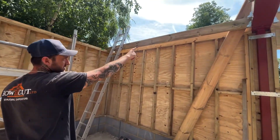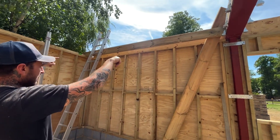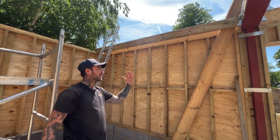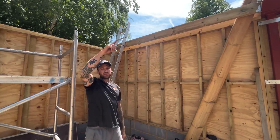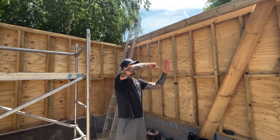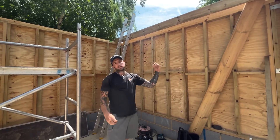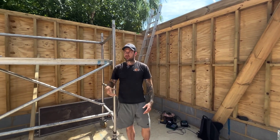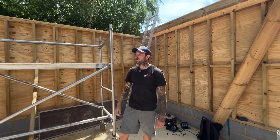To tie the roof to the walls, I've done a couple of notches under each joist. I'm going to bore a hole through the ply and put an L-strap on the outside of the ply, recessed in, 1200 long, so it'll come under at least three or four joists. It's a lateral strap that'll go underneath, fix the joist blocks in, and tie to the wall — both sides. I'll do a time-lapse of fitting all the joists, then the front ones, and come back once they're all in.